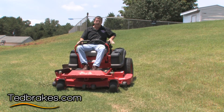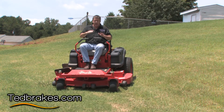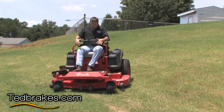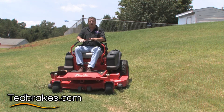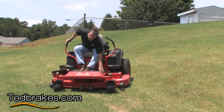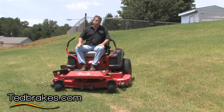The Bad Boy's not bad — the lever's here on the side — but having front brakes is just natural instinct. I've seen some mowers that actually have the brake pedal located way to the left and to the front. The experts have a name for this: it's called the Death Grip. When you're coming down the hill and you see what could kill you, you want to go backwards further. The Death Grip is when these handles get bent because you cannot reach neutral position to get to that brake. If you don't put the brake within reach of the operator, he has no chance of recovering from a loss of power or a pump belt breaking.